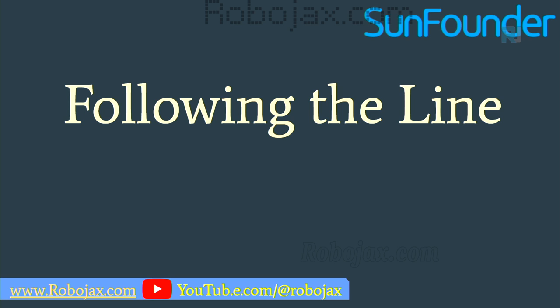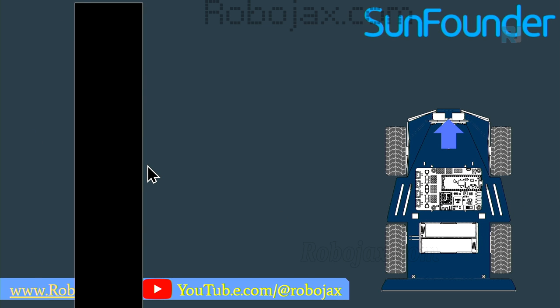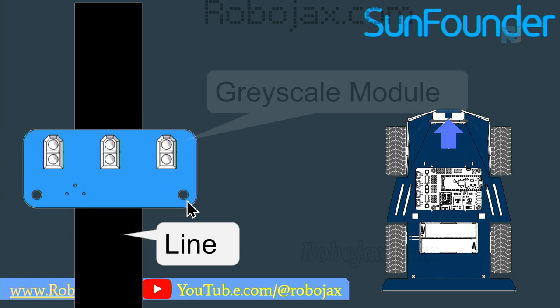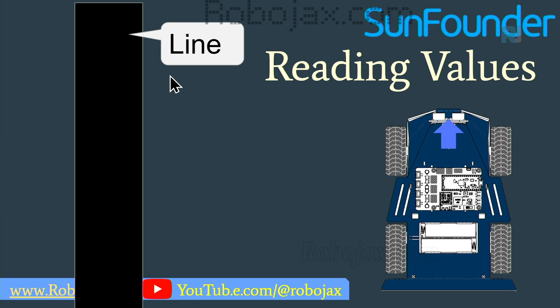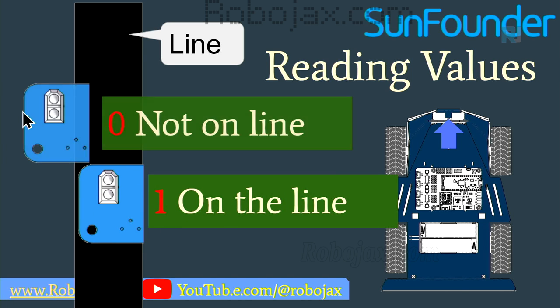Now, let's see how following the line will work. So first we have our car, and then we have a path, a black line. And then we have this grayscale sensor. Our grayscale sensor has three sensing elements far apart like this. Now when we read the value, if the sensor is on the line, we will read one. But if the sensor is off the line like this, then we will read zero. So remember, one is on the line and zero is outside the line.